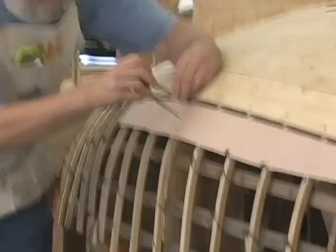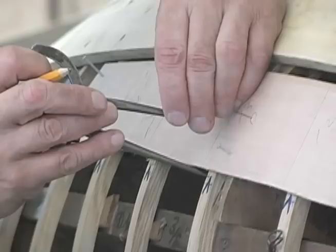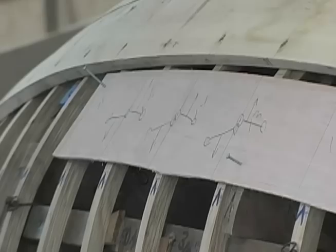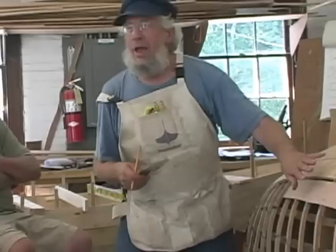Do you need one of those battens for every plank? Do you have one in your shop? Do you store them? Yeah, you could. And this sounds kind of tedious. It kind of is. But if you were working by yourself and you took care to set this boat up the way that we've been doing it here, this spiling actually works with both sides. Does this boat have maybe too many ribs? You can take some out. You could, but it wouldn't be right. Anyway, eventually you could have patterns. But of course, this is me doing a prototype. Yeah. Okay.